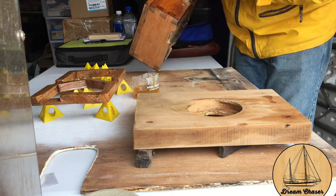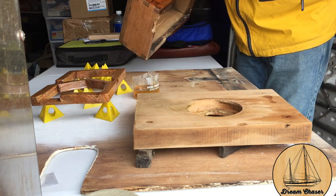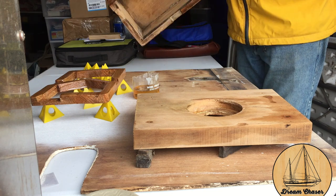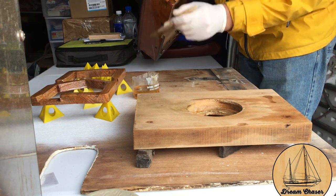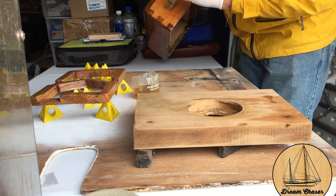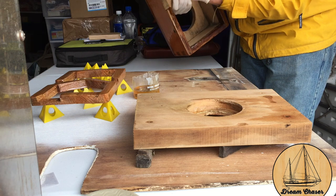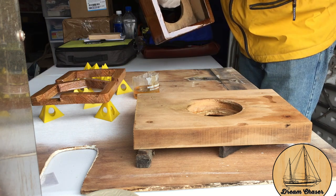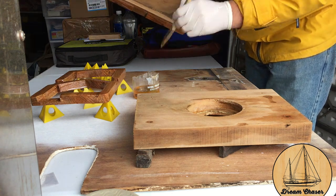This will be the point where water will always be making contact. I'm not going to do the entire box on the inside, just along the base here. I'm not going to do any more than just this because that's going to make it even tighter on the frame. You'll notice I'm not doing anything with the screw holes because I intend to re-drill them out, countersink them, and I'm debating whether or not to put plugs in them. I think I might just leave the countersunk stainless steel screws exposed — there's only going to be five of them, two on each side and one on the front — that'll give me easier access if I ever need to work on this without having to refinish it all every time.